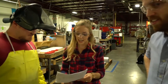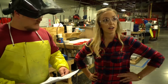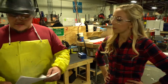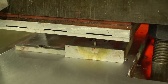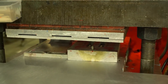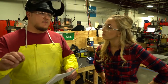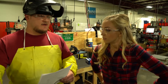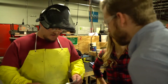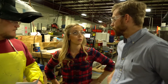Yandere is going to be pouring the mold. The mold is heating up right now — it's got to reach about 230 degrees, or we'll get a temperature-related issue. If the mold isn't at least around 220 to 230, you'll end up getting little skinned-over bubbles on top, on the back side or the bottom. That's your indicator that your mold is either too cold or too hot, meaning your product is going to be ruined if you don't get it to the right temperature.